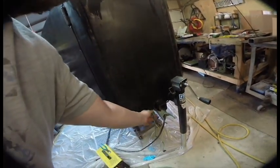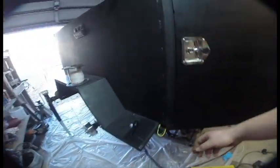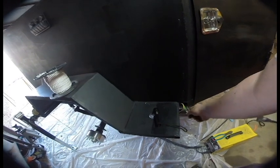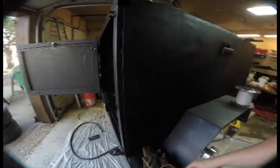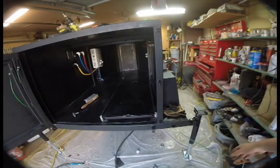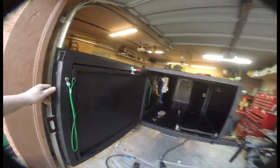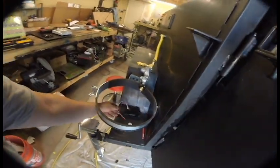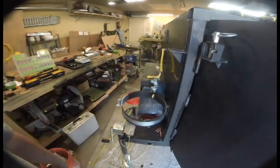In terms of trailer wiring, there's a grommet here and we're going to install another grommet there. It runs through the frame — I basically just used a fish wire to get it through. We're going to tap into the license plate light, run it up through here and over there, because accessing down here is pretty much impossible without cutting more holes than I'd want. Green is on the right, yellow is on the left, running across inside the bumper. Now we just have to get these lights mounted and install the license plate light.